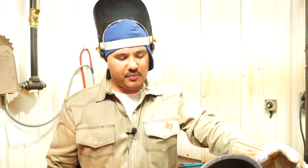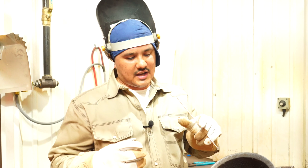Anytime, whenever you're testing on a 2-inch or a 6-inch pipe, whatever it is, even on stick, always keep that in mind. Offset your tacks a little bit to your harder side, and that'll make life easier on you on trying to make that root pass.